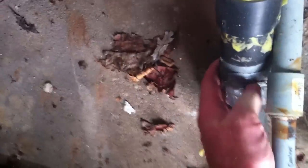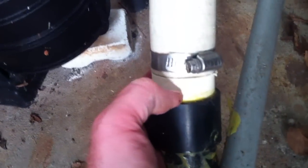Here we have an interesting equipment installation. The pool was plumbed with poly pipe, and it looks like someone heat-bent it — but they didn't do it right; it's crimped over right here. They've then glued an inch-and-a-half ABS coupling, followed by a short pipe stub of some other material, then an interior-fit barb fitting, and then inch-and-a-half flexible PVC. This is just a disaster — there are like ten things wrong between here and here.